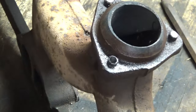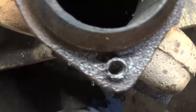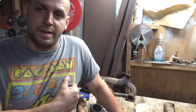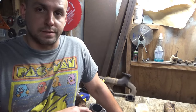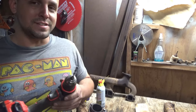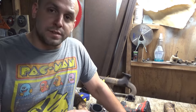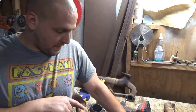Well, that would have been a miracle if I could have got it out like that. I just wish I had one a little bit smaller than that. Since I don't have an extractor, and I do have a hole all the way through it that's probably not touching the threads — I'm probably good on that. At least we did prove one thing: you absolutely can drill that. These were some really cheap drill bits I bought a long time ago — like a 64-pack for 10 bucks. They kind of suck, but they're sharp — they don't last very long. But this one is probably still good. That surprised me. Maybe these are not that hard. But at least you know you could actually drill that if you had to. So we're learning here — the video won't be a complete waste.